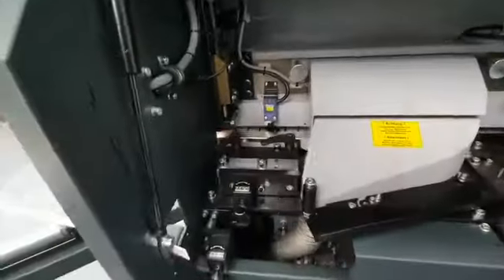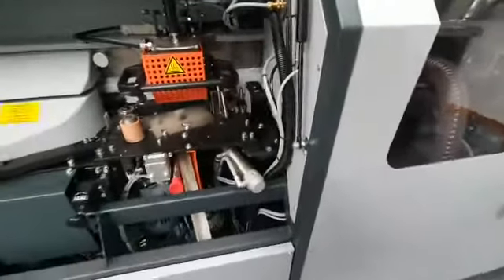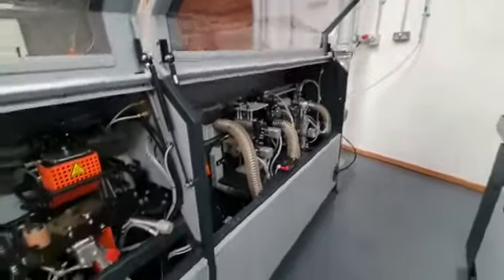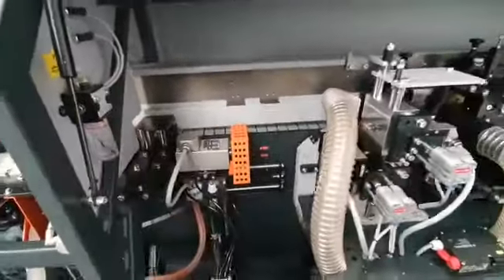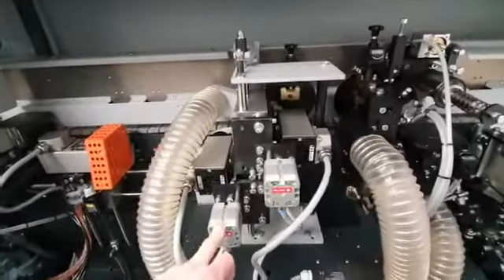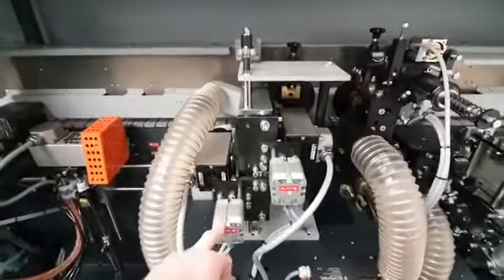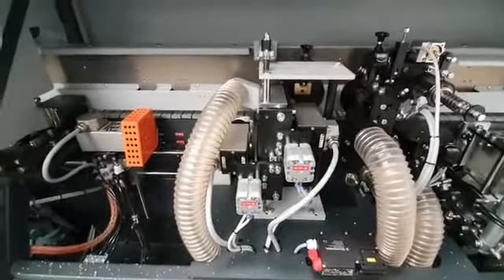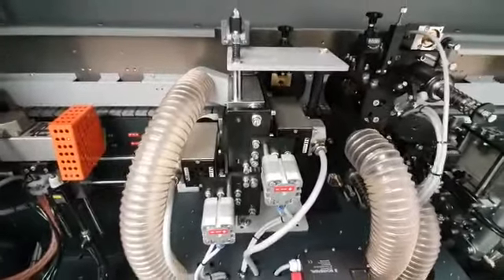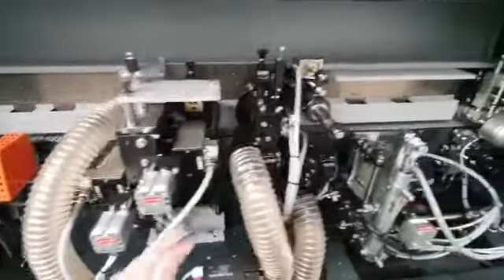The machine is made in fantastic quality and everything is easy to use. Opening the back door, inside we have the single end trim saw and top and bottom radius trimmers. These trimming units feature pneumatic preset positioners — this machine has automatic positioning into two positions, for example two millimeter radius and flat, or two millimeter radius and chamfer. The position is completely controllable from the front end.